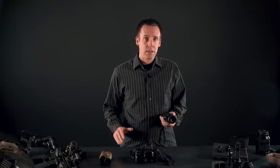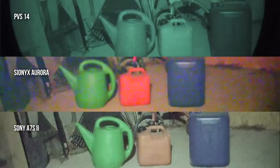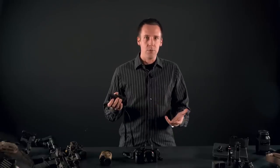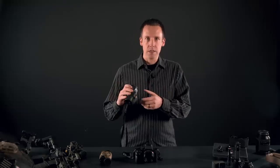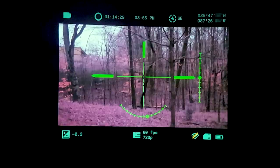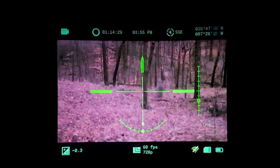There's more to a night vision device than raw light sensitivity. Once the Aurora has enough light, the resolution and clarity are more like an average Gen3 tube than Gen2. And it sees in color — the PVS-14 sees more clearly in really low light, but it can't tell the difference between a gas can and a water jug. Color could be really useful for a lot of applications. There's also image stabilization, a compass and GPS so you can see heading and location coordinates in the viewfinder, plus clock, battery life, and all settings displayed.